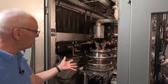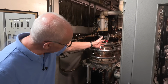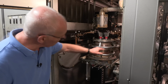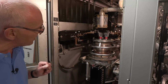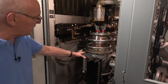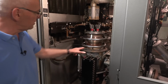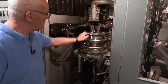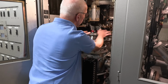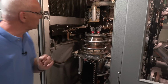And actually here are the output stage. Left hand side of the modulator, right hand side through there. This is a glass tube. You can see the construction inside through the glass. The other one, the more modern one, the other side is ceramic. Vapor cooling again, so water in the bottom, overflows the weir, the steam and the water go out through the exhaust pipe. Triode, anodes there, control grid here, just clipped on, and then the filaments with air blast cooling to keep the seals in good condition.